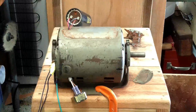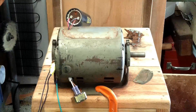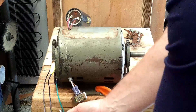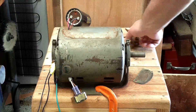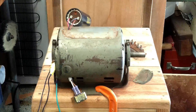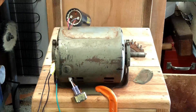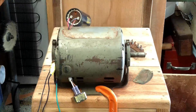I don't know how to apply a load without flipping this chair over, so I'm gonna refrain from doing that, but there's no other magic going on — it's running on 115 volts. The magic starts when you click the switch for the first time; it has the ability to start this motor without needing one of these. You can probably do this all the way up to three or five horsepower if you get a switch that's big enough. It's a good way to save an old motor if you have no other recourse — some of the parts for old motors just don't exist anymore.